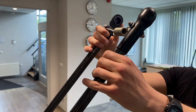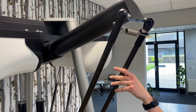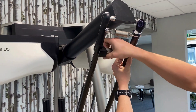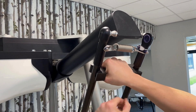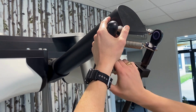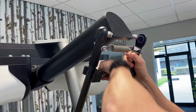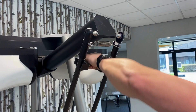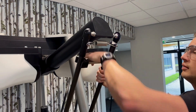Now, again, I do the same. I place one side already on the ball joint like this, I hold the other one, I take the spreader, I place it again pretty high — it makes it far more easier to spread them. And then I turn them out, make sure you keep them in position like this, you turn them out. And you see, when you have enough space, on the last bit you can help it a bit to make sure it pops on easy. Now it's on, you release the spreader, and they are in position here.